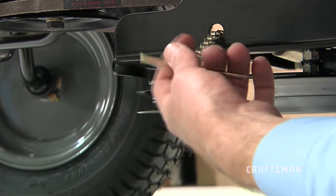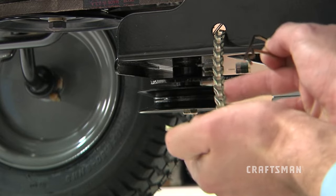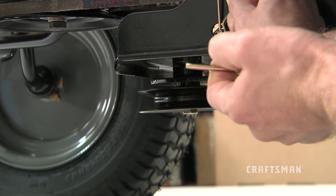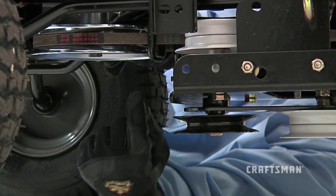Next, place tension on the belt by pulling the left side tensioning chain out as far as the 3/32 inch hairpin cotter on the chain will allow. Then secure the chain into this position by inserting a 1/8 inch hairpin cotter through the chain. Please note: do not assemble the drive belt around the outside of the keeper bolt beside the large pulley.